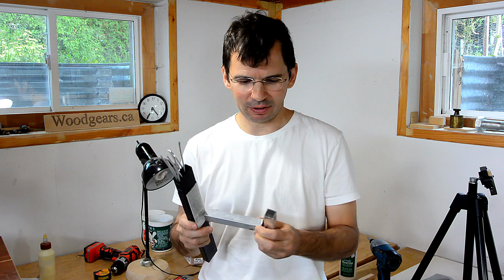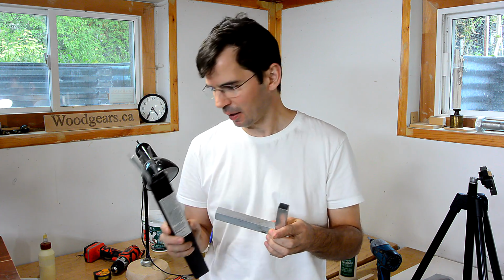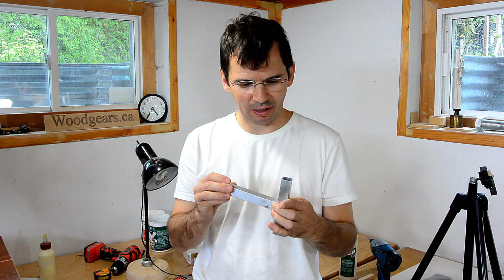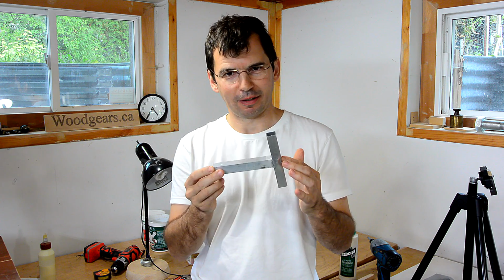I bought some brazing rods to try to braze some of these back together to do some more tests, but with a propane torch I just couldn't get enough heat, and then switching to a MAP gas I just couldn't get a decent joint going. I just didn't have the patience to try to make this work. These brazing rods are really more meant for patching holes, and for actual joining pieces together I think TIG welding will be easier, quicker, cheaper and faster, as long as you have a TIG welder.